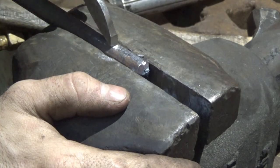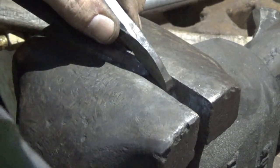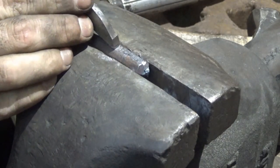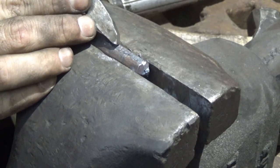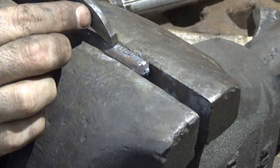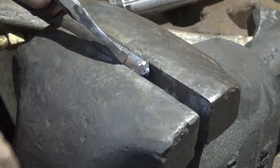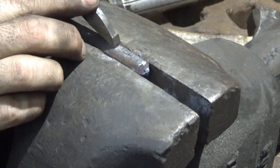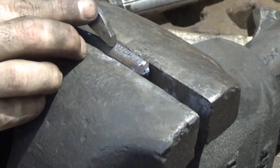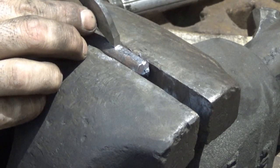You also want to keep track of this angle — you don't want to veer off the shaft, you want to keep down the center line of whatever you're cutting. A scribe line might help you with that. And then there's the roll angle of the chisel. On something round like this it's more of a problem; on flat bar it's not. If you tilt the chisel up like this, you have a tendency to go down the slope and veer off to the right. Same idea the other way — tilt it and you'll fall down that slope. So you need to keep it tilted at center and angled right on center, and then adjust your cut accordingly.